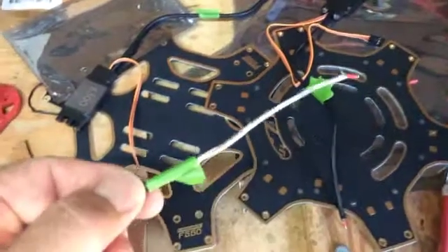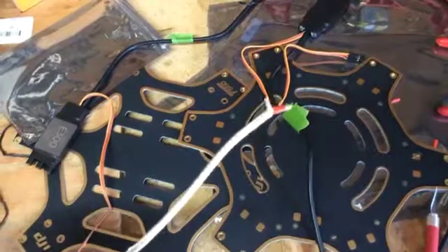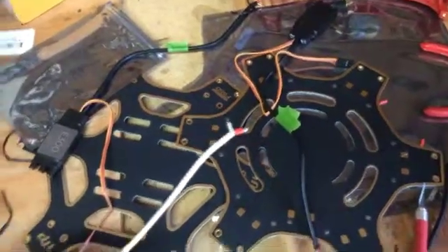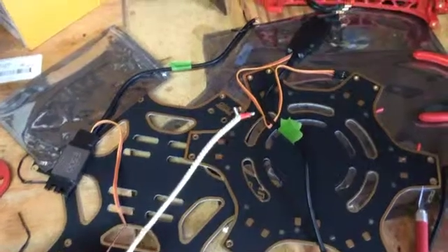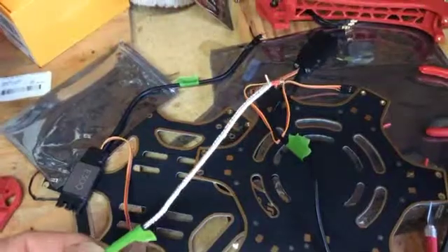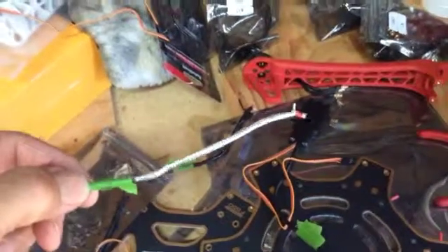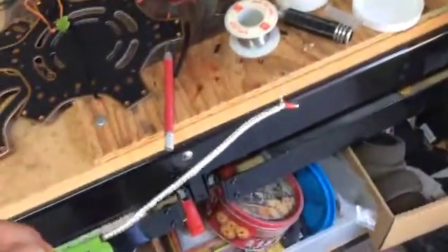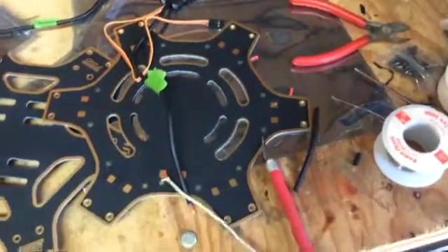This is with the black stripped off, and you can see you have a little tab there. The issue with this stuff is once you start to cut it to pull it back some to get the distance across, it falls apart. It's not a woven piece of metal from one end to the other — it's probably done in short, maybe one-inch sections, because once you get past a half an inch it'll just fall off when you're trying to split it open with a fine razor blade like this, being very gentle.